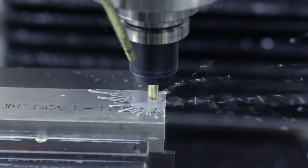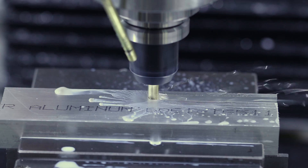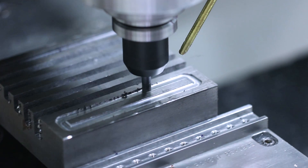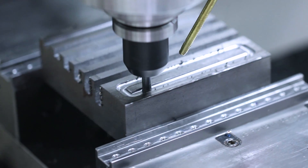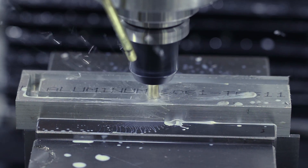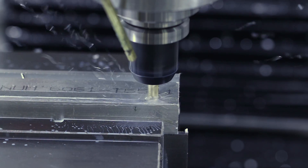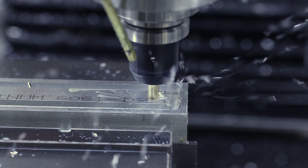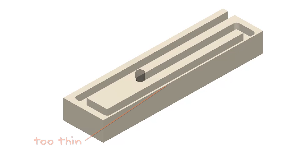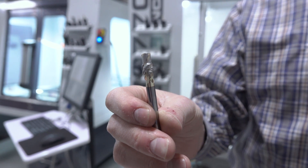So what makes slotting so hard? The number one reason is chip evacuation, and this really relates to aluminum. It's ironic that slotting can actually be easier in materials like steel. Granted, steel tends to require more horsepower or a more rigid machine. Aluminum has a lower temperature at which it really turns into a gummy material, which is why chip welding aluminum onto an end mill is a known problem. One of the tough things about slotting is that it can be inconsistent. Heat can build up over time, or if a coolant line gets bumped, or if the angle of the cut changes — even if you come up on a thin section of material, that thin section may get hotter more quickly, causing the material to reach that gummy state, and it all goes south.